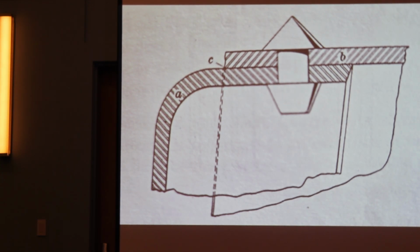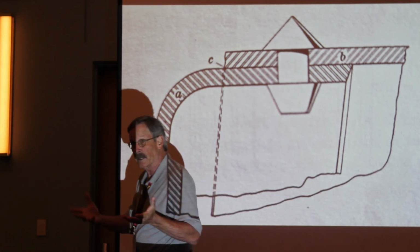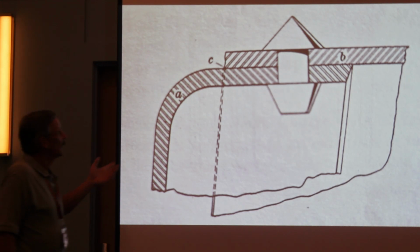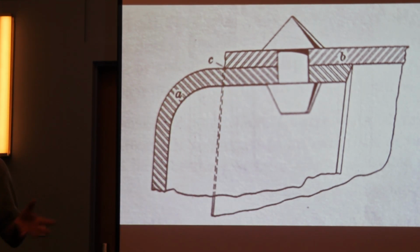And the heads of the rivets, again, it's going to get hot over time. It's going to burn the carbon out, because in fireboxes, it's kind of warm in there, 2,000 degrees plus sometimes. On the water side, corrosion. Water, after a while, is going to start corroding the heads of the rivets. So, in the firebox, this will last you quite a while, but the N&W, as Tim mentioned, was the first railroad to weld fireboxes. And this is just the inside of the boiler shell itself.